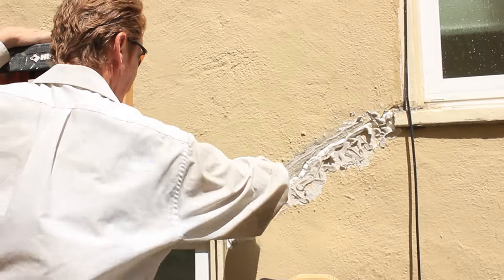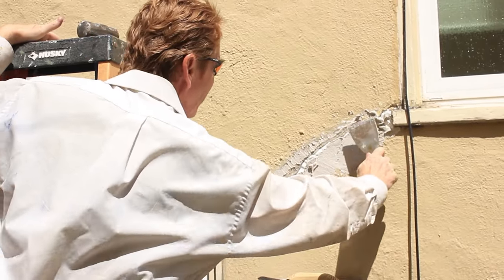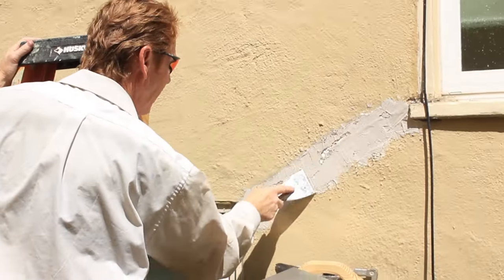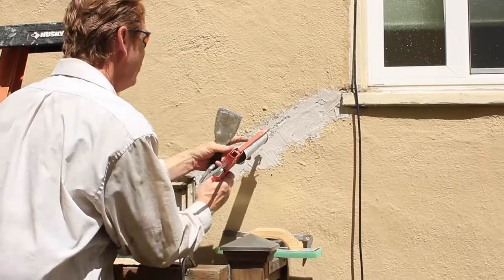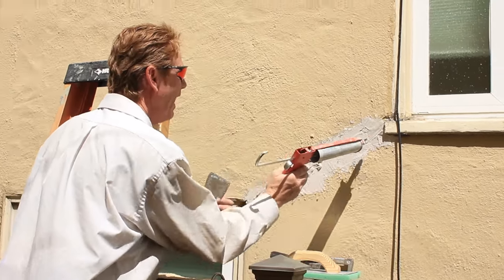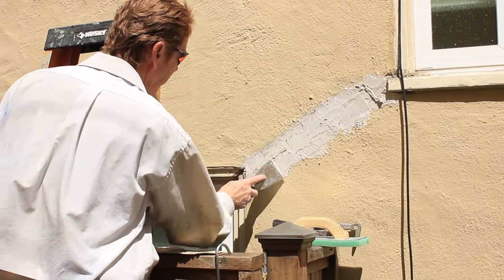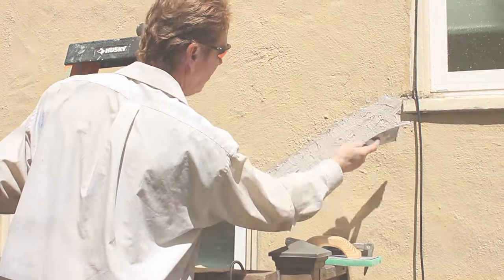Now that I got that done, I'm just going to take this little putty knife and feather it into the sides with the Moreflex, because I'm getting ready to float this. I've got the benefits of both worlds. I know there's going to be some engineer out there that's going to say you can't mix those caulkings — I say this is for a friend of mine, and if there's a reason why I can't, I'm just an applicator, not an engineer. Another way to do this is after getting that caulking in there, I can take Weldcrete and put a bonding agent over it and then put stucco. But if I put stucco over this, the stucco tends to be brittle, and when this wall moves — and guys, it is going to move — it'll re-crack.